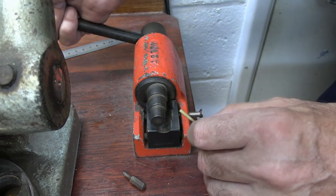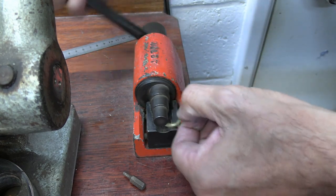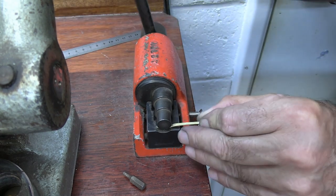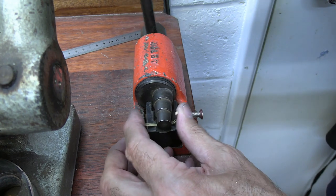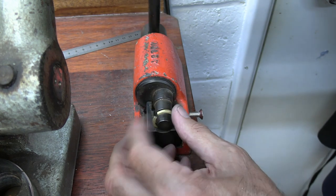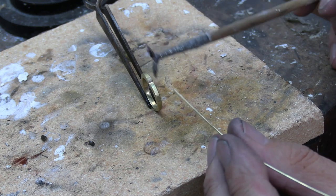I'm still very confident that I will be able to work it up to the right size. I'll use my ring bender to first of all start the bend right at the ends — do one side and then the other — and then you can just concentrate on getting the two ends together. Make sure that there's plenty of flux on the joint that I'm going to fuse.